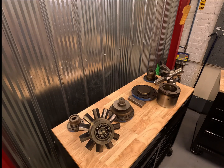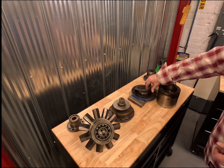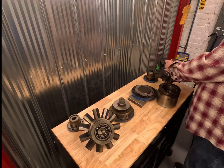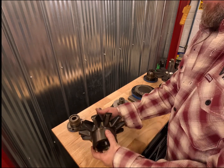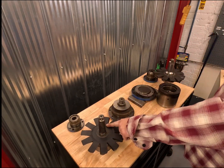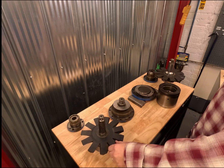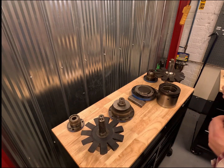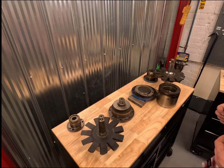Assembly and disassembly for these are essentially very similar. The gates themselves have the same retaining ring on them. There are bushings for the gate and the float. Float checks, backlash check, shelf clearance, axial checks — they are all measured in the same way.